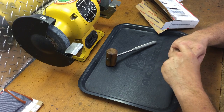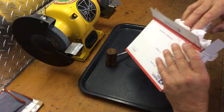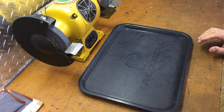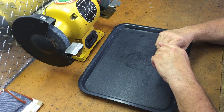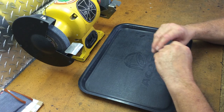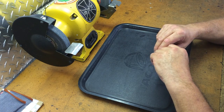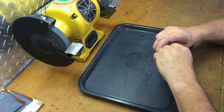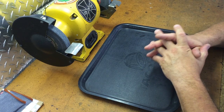Next on the list, I want to mention Off Track, the tractor wheel project I'm doing for a friend. I know there's many ways to do this machining operation. I think optimally it would be better to have drilled the hole closer to the size than maybe bore it two or three times to an exact size. I don't have drill bits over 1 inch, so I had to use what I had. And I only have a 2 inch boring head. So that leads me to my next little issue.